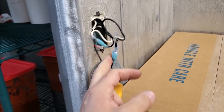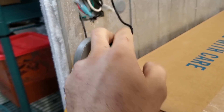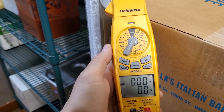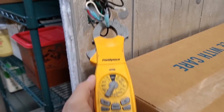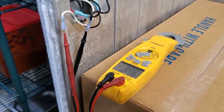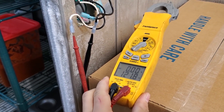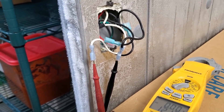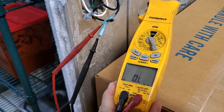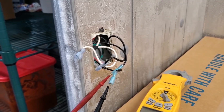I'm testing the door heater wiring. It goes in here behind this heater track, and we've got no current draw across it. We're going to check voltage to make sure voltage is being applied — it should have 115 volts going to it. We have 120-121 volts going to the heater. Let's ohm out the heater now — and we have nothing. So the heater has been severed somewhere inside there.